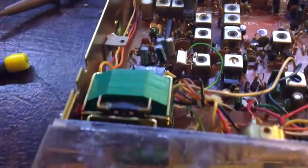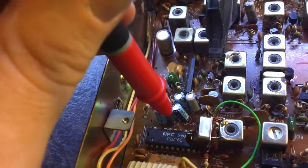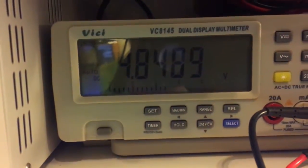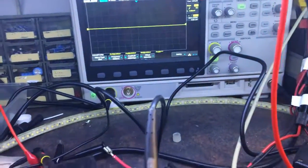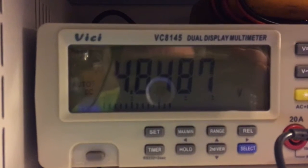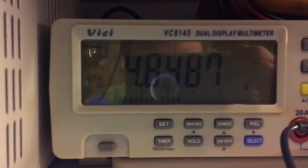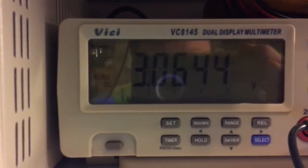Now I'm going to set the VCO on the bands to make sure it can cover, because it switches VCO frequencies between RX and TX. I'm going to measure the voltage — there's a nice point right on the internal resistor — and I'm getting 4.84 volts. That's from channel 1 on New Zealand, which is the highest voltage it will generate on receive. I need to adjust that voltage down because it's too high. It's a little tricky — I've got to hold the probe, turn the pot, and hold the camera at the same time. This needs to be usually around 3 volts or so — works best.